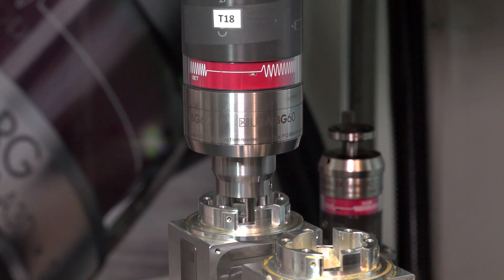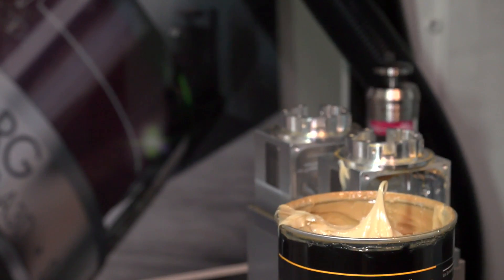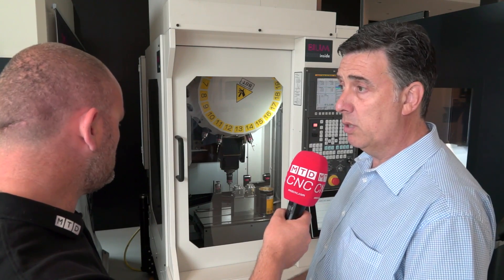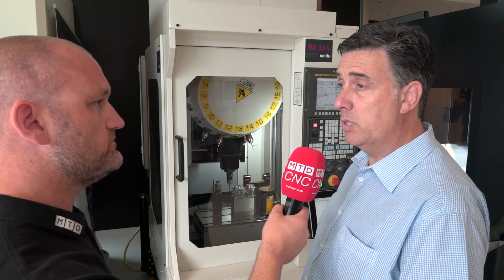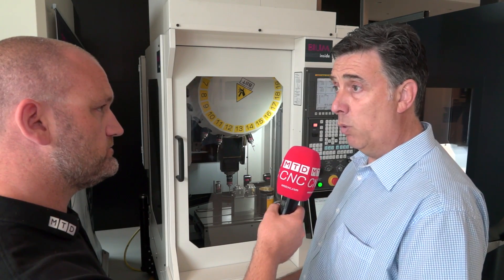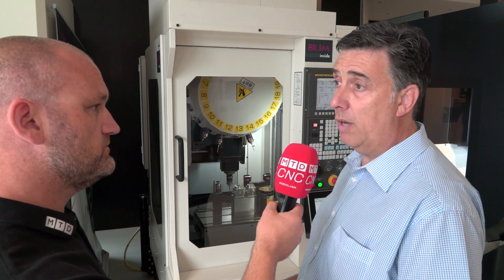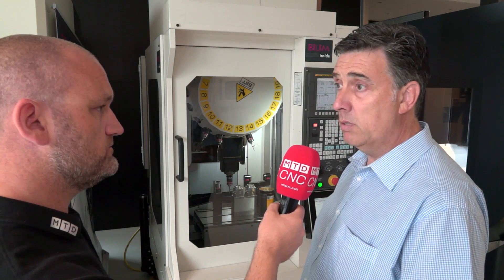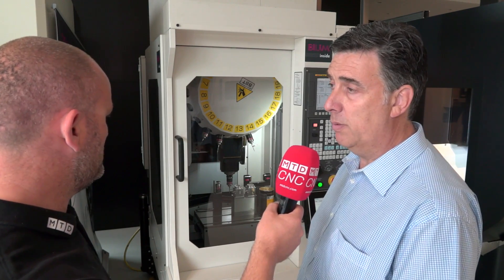Can you change it? Is it a closed loop? The idea is it's a complete closed loop system, so the bore gauge can come in whilst on the machine tool. It can measure — the traditional way is we do a first pre-measurement of the bore to determine what the next cut is, then you make an adjustment to the tool offset, make one final cut, and come back in with the bore gauge to do a final inspection of the bore.